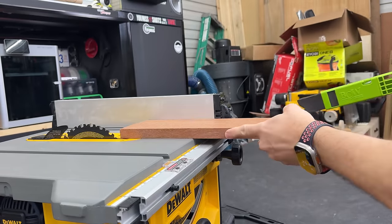That's why so many people have outfeed tables behind their table saw. I have mine slightly lower than my table saw top so that when I make a cut and the board tips over, it just lands on the outfeed table. Not everyone has space or budget for an outfeed table, but roller stands are fairly cheap — around $20 — and that'll help keep boards supported so you don't have to reach over and grab things.